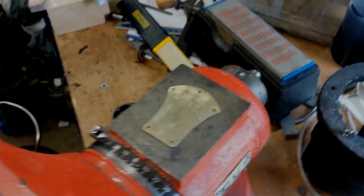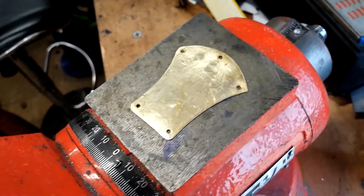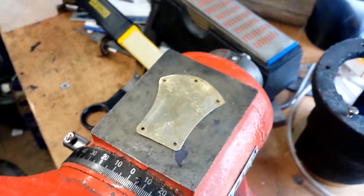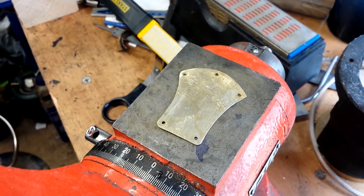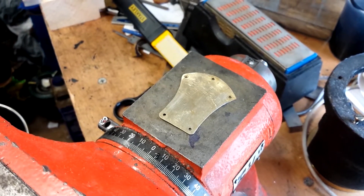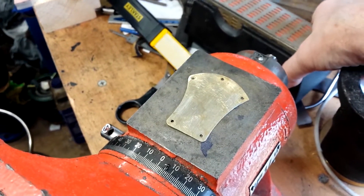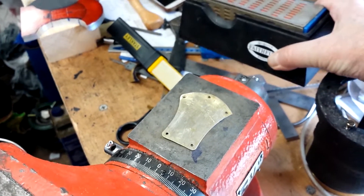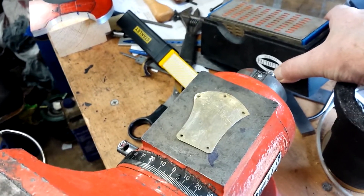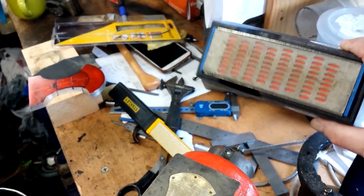The wear plate is made of quite thin brass and as you can probably see it's got quite a lot of scratches on it, and one or two of them are quite deep. It's going to need to be lapped so that it's very smooth, because the cylinder has to oscillate against it and between the two of them they have to make a steam-tight but moving joint. Following advice from the forum, someone advised me to use a diamond lap — a plate of some kind. I was going to use this one I've got for my wood chisels; it's got four sides of different grits.